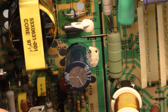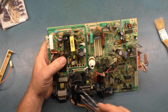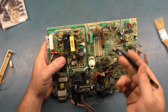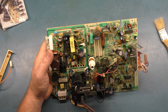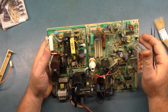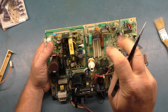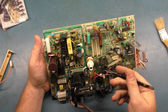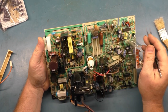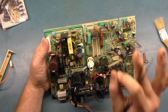Of course, while we're waiting for this to dry out, we can talk about things. If you have a totally dead 5000, I don't know if this is 74, 75, 2000, 5000, it's all the same. It's not exclusive to the 5000, what I'm going to talk about. This one just says doesn't power on. So it could be a power supply problem, it could be a HOT, it could be Q703. But let's just say, for instance, you have a totally dead chassis, it does absolutely nothing.